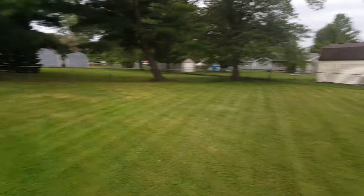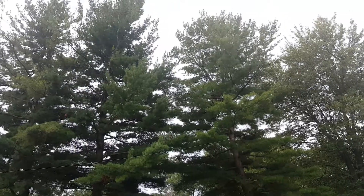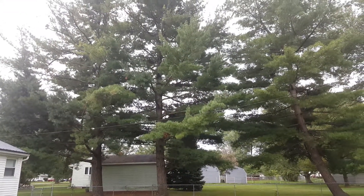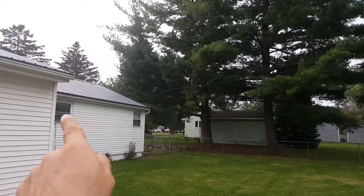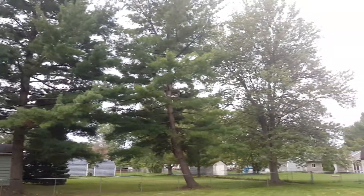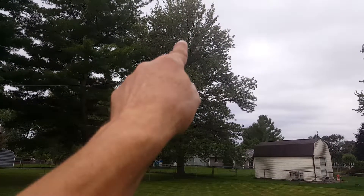The reason why I built that antenna — that's my ham shack. Those are my antenna supports. I've got a dipole, an inverted V for 30 and 40 meters up in those pines. Hard to see, but there's a piece of white THHN stranded 14-gauge that goes up to about the 40-foot point there.